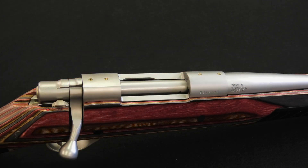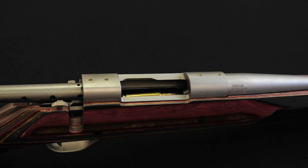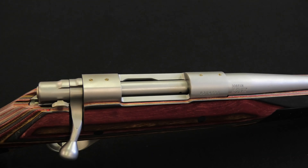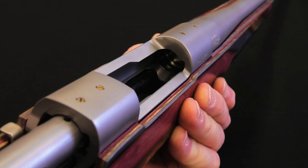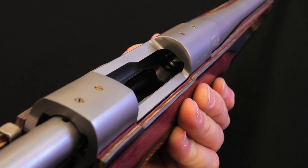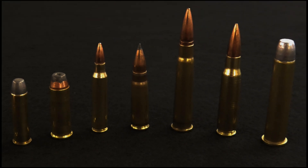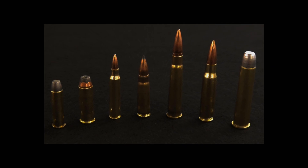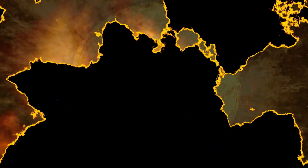There has to be enough tolerance for a cartridge to be inserted, form a tight gas seal when fired, and then be easily removed post-firing. A gun's chamber is built to withstand very high pressures, albeit within set limits. Provided these limits are observed, the chamber will safely allow the cartridge case to expand and form a tight seal. Brass was found to be ideal for cartridge cases because it can expand and contract very rapidly. When we talk about chamber pressure, we're referring to the pressure exerted on a gun's chamber as the round is fired, and before the bullet goes on its way.